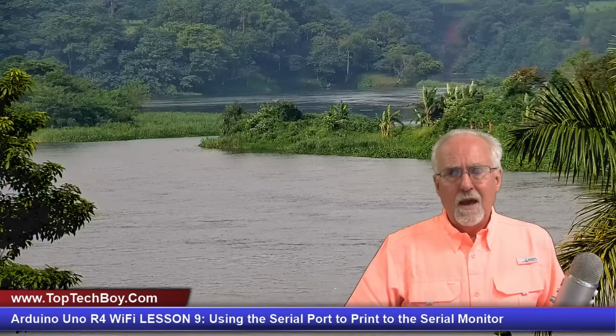Let's jump in and talk about what I am going to teach you today. I'm going to teach you how you can print from the Arduino to your desktop computer screen. Now, why is this important? Well, we're going to be doing all types of interesting things on the Arduino. Let's say that we hook up a temperature sensor to the Arduino and we're measuring temperature. Well, we need to display it somehow. So how do we do it? We print it to the serial monitor on your computer screen. And that's what I am going to show you today. Sound good? I hope it does. So I will get out of your way and have a sip of coffee.